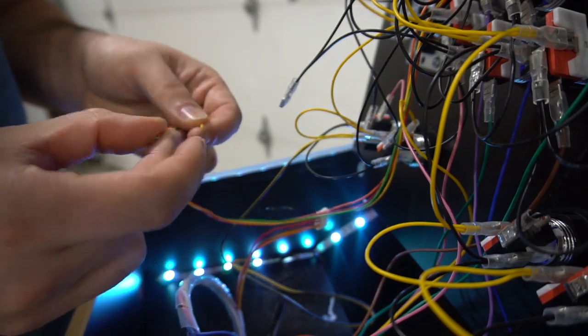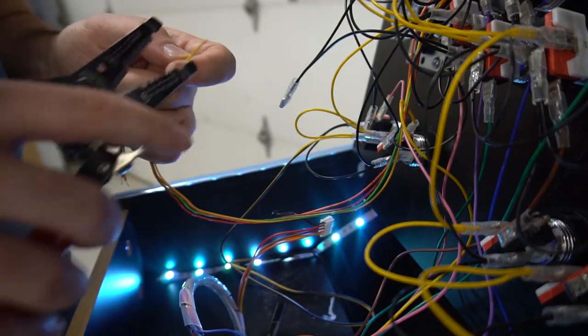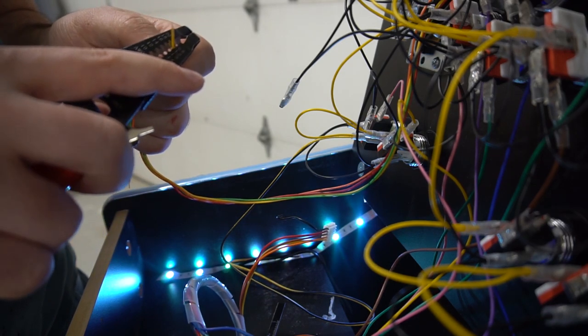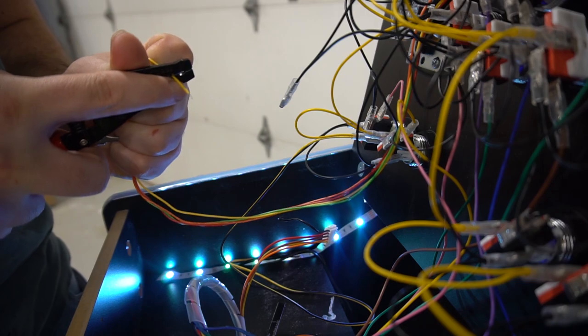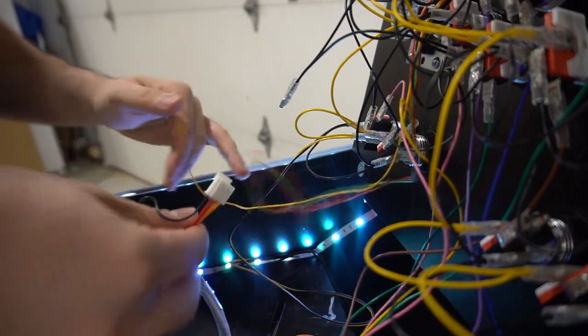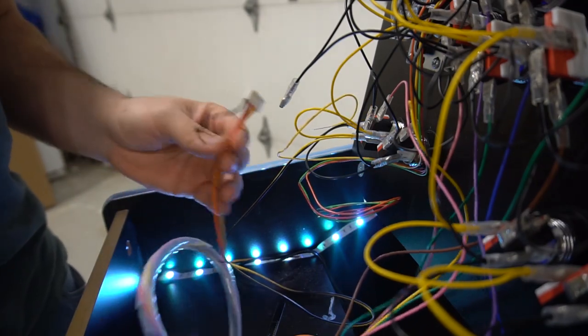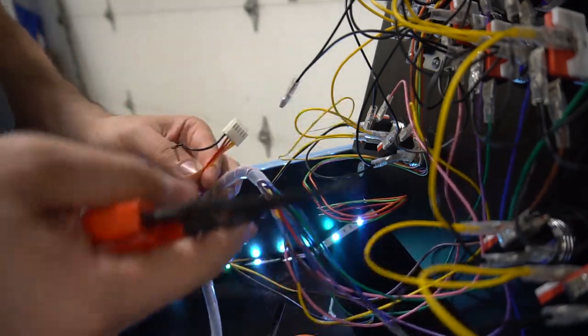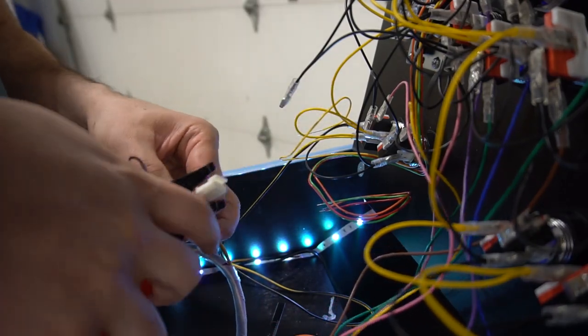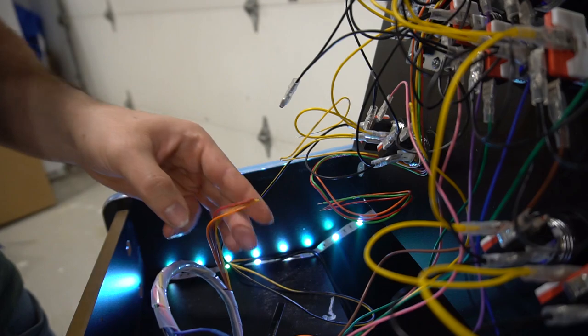Basically, I'm gonna splice this, and on joysticks, and again, we're doing the heat shrinking, all that. I do like to add a little bit more of a length to it. So figure at least about maybe an inch and three quarter when you splice this. Now we're gonna take our player one. As you can see, we do know our player one is here. We're gonna take our player one, and now we're gonna cut the white head off, just like so.